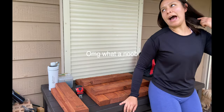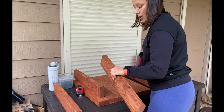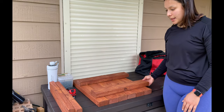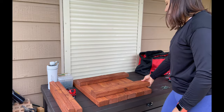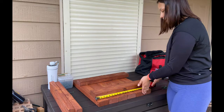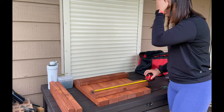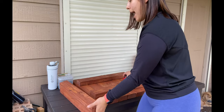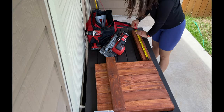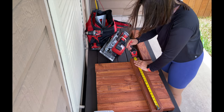My goal for this video is to only use the wood that I have. I want to keep the cost low and keep all the supplies and materials to a minimum. These planks are going to be too long — they hang over about an inch and a half. This is 22 and a half inches, and the actual boards measure out to 21 inches, so I'm going to cut them an inch and a half shorter. I'll also cut the leg boards in half so I don't have to buy any more wood.